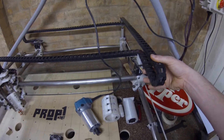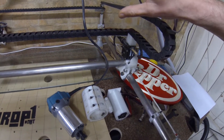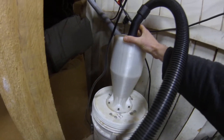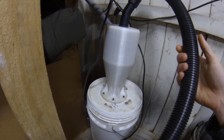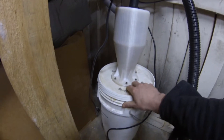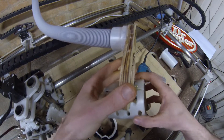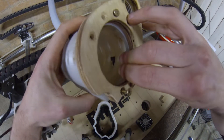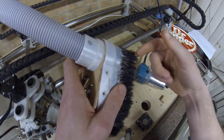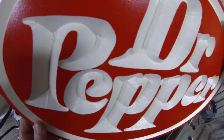My cable arrangement has been working well — I haven't changed it at all, the cable chains are supporting themselves fine, and the electronics haven't missed a beat. I've also 3D printed a dust cyclone attached to a 25-litre bucket hooked onto a cheap shop vac, and that's working really well — most of the dust ends up in the bucket. I've put a link in the description for the dust cyclone design. I also made a dust shoe that I quickly slapped together for MDF work, and my next spindle mount design will have a clear acrylic dust boot that hose clamps to the bottom of the router, with the brush bristles not hanging so far down to give the Z axis more travel.